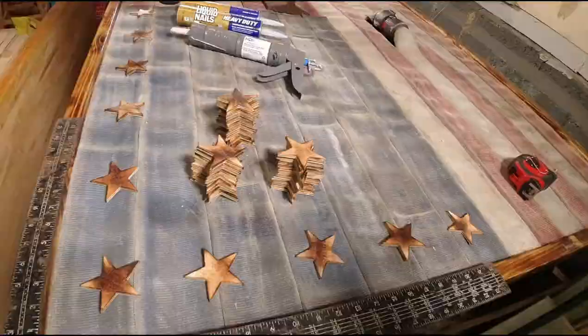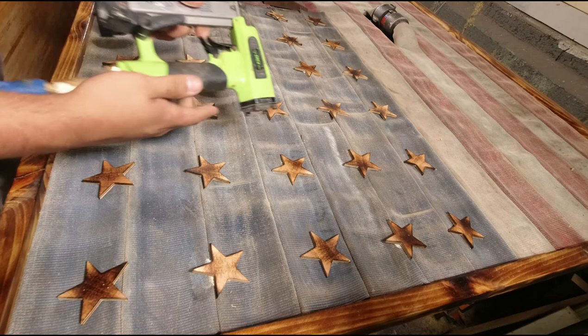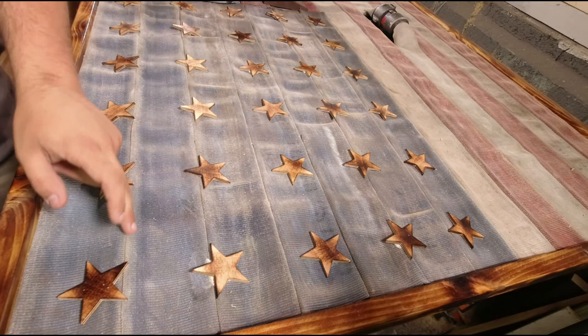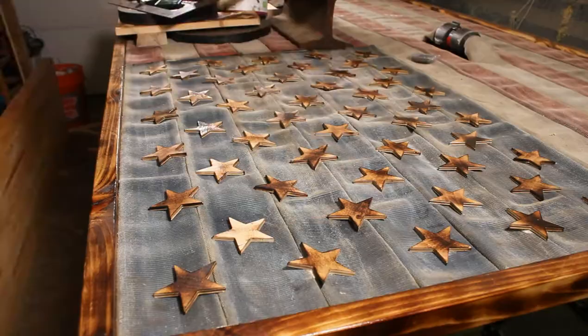The first section is done. During the time lapse I started using my 23-gauge pin nailer with half-inch nails. A flag is made up of two grids of stars: there's a five-by-six grid, which is the one I did first, and then an in-between grid of four-by-five — together that makes up 50 stars for 50 states. Now that the glue has started, I'm going to finish gluing the bottom half of the flag.